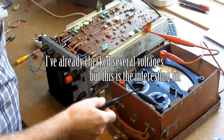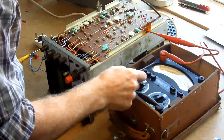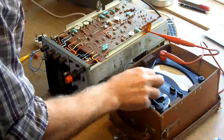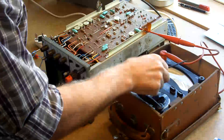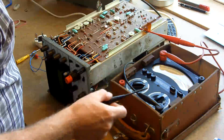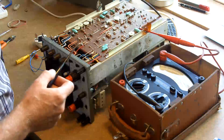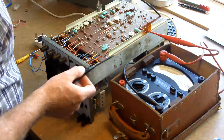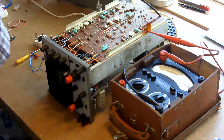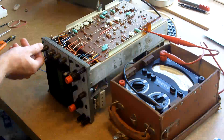I've got the EVO on the 3000 volt range. I'm expecting it to be about 1.8 kV, so that should come up to about there — DC, because it's after the rectifier. I'll plug it in and switch it on. I guess it's got one of two chances — right, bon voyage.